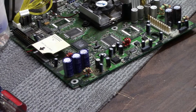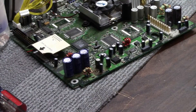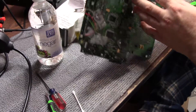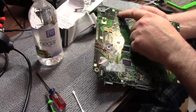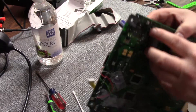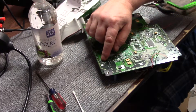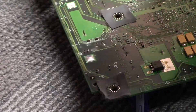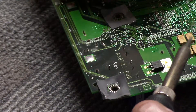For that we're going to use vinegar to clean the area, and we're going to use 91% IPA. We've got to take off this capacitor — this little tiny one right here. For that we're just going to use solder braid and remove the pins. All I'm doing is touching these two points with the braid and then removing the solder around it and the capacitor itself.